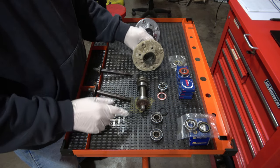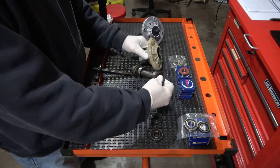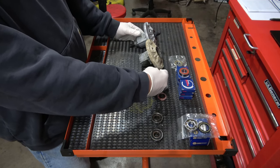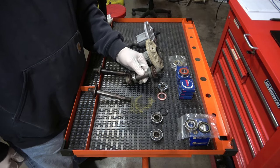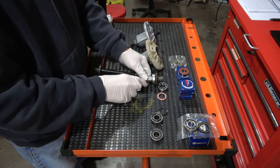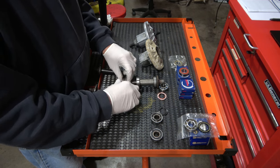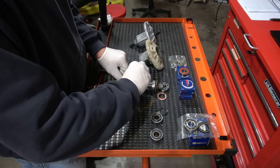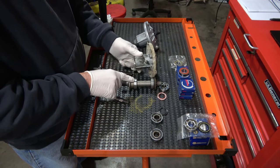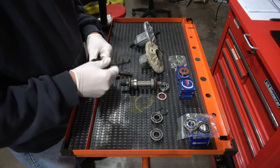But I pulled the guts of the unit out, and in essence this is the spindle and assembly as a whole. You have the cap that's on the end, the part that's on the bottom, two bearings, and a shaft that holds it into place. This is the correct orientation, but I'm going to flip this around for just discussion purposes. When this is assembled, it's all housed in here. The cap is reversed the other way, and they push against the bearings.